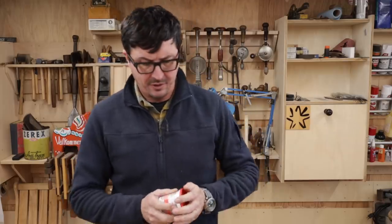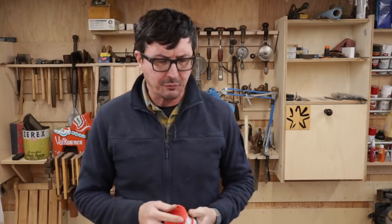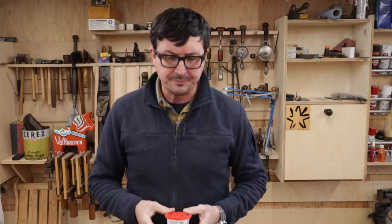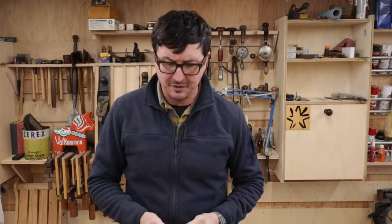So what have we learned? You can cut holes — you can drill through glass, mirrors, bottles, ceramic tile with these bits. What seemed to work best were these little Bosch glass-specific guys. It's a little nerve-wracking working with glass because you always feel like it's on the verge of breaking. But it can be really tough too — just go try to break a car window. I've seen guys throw bricks at them on videos and the thing comes back and hits them in the head.